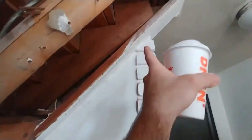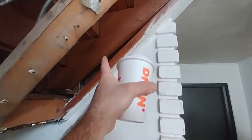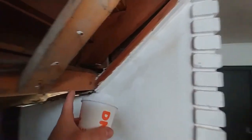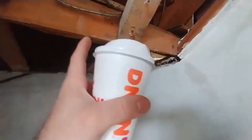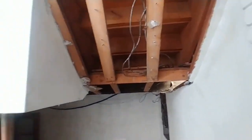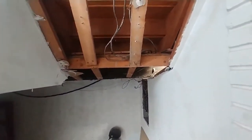And I started to look at how this is soffitted down. Really, the plane overhead here should have been just pushed along the back of the stringer and then dropped here if necessary to be square, and then go level again across here to this joist and then drop down again. Instead they jumped across everything here for the sake of making it easy to close in, but really it makes it more claustrophobic than it needs to be, even though it's easier to finish.